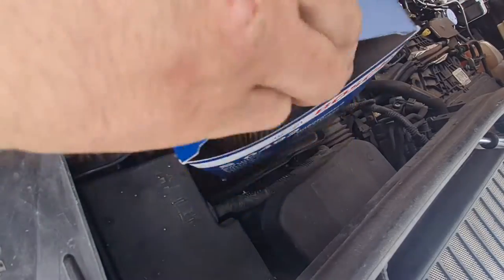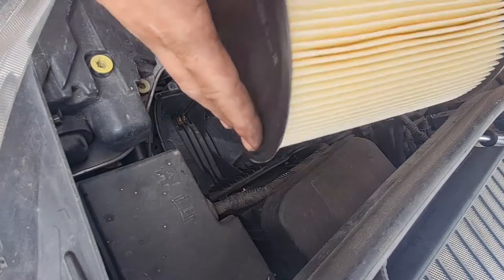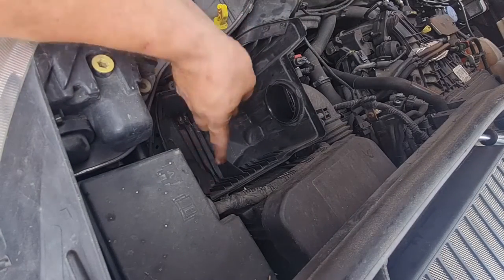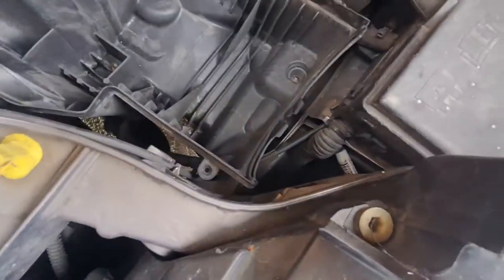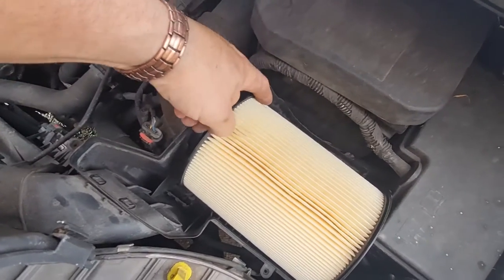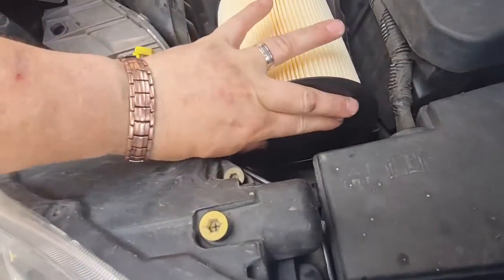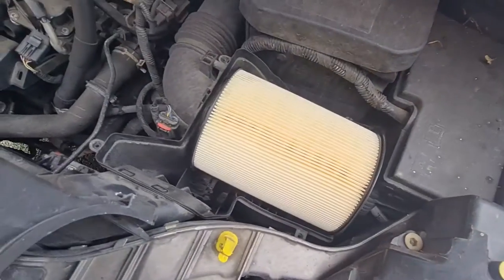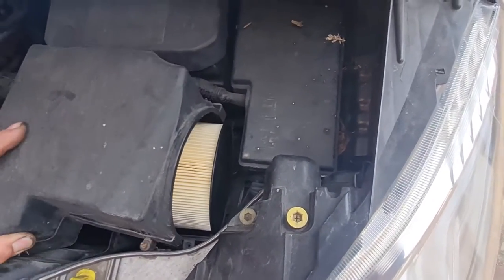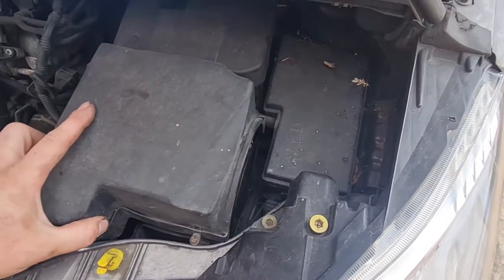Here's the new one in the box — looks nice and clean. Nice new filter. You can see the pipe there — basically push it onto that pipe. At this end it's got like a lip on the end of it, and that slides into the groove in the box. There's a groove in that box right the way around this edge. When you put it in, put that end in first to get it on the pipe, then that end you have to squish it a little bit and it will pop into the end of the box. That is now a new filter in — easy as that. Just put the cover back on, do the four bolts up and we can carry on to the next one. I'll get this cover put back on — it's four bolts, as you saw me just undo — easy as anything. Then we'll go on to the next filter.